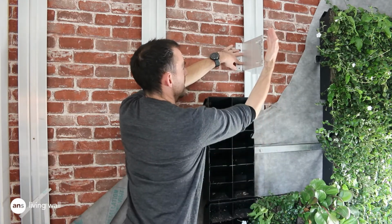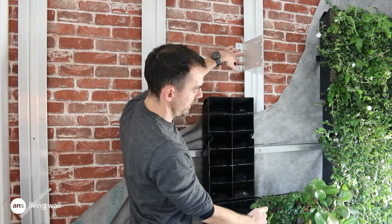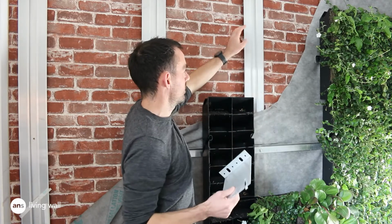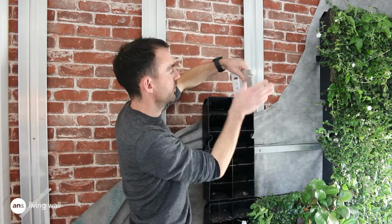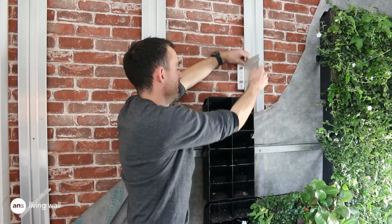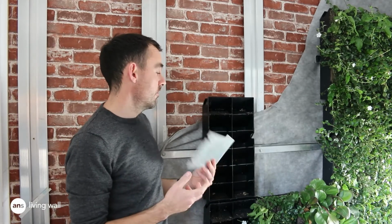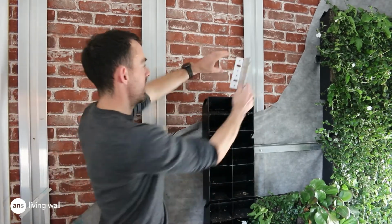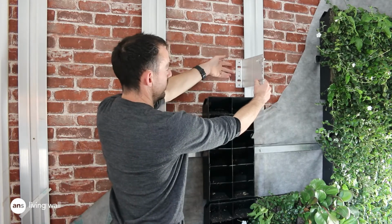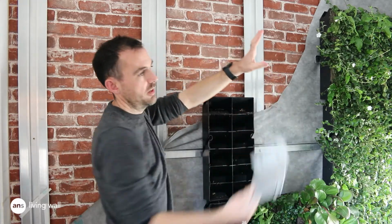and then into the bracket you attach an L or a T plate, which will then join all the helping hands up. So you'll end up with a fixing plate on the front of this, similar to the top hat that we use. And again, these are generally at 600 centers, so we'll be attaching a 4mm aluminium hanging rail to the front of the helping hand system. The benefit of these again is that you get this cavity between the SFS or the building itself and the back of the living wall module, and you can fill that with insulation.